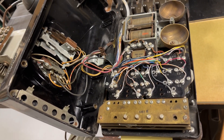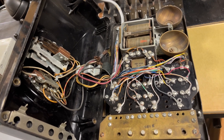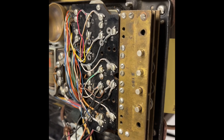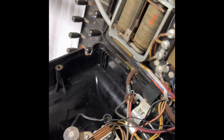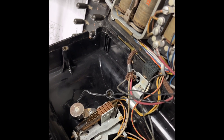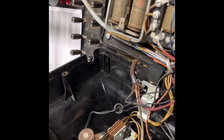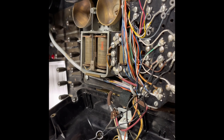The mounting cord was cut off when I bought this phone, so I've added a cable to hook up the lines. The telephone needed a minor adjustment, so I had to disassemble the key strip and make a slight repair on the keys. While doing that, I also added a high-voltage buzzer because these phones only had one ringer, and in order to have the second line with a ringer or common audible, there was a separately mounted ringer. Bell practice did show a bracket and a buzzer that could be mounted inside the phone, but I've never seen one of those.